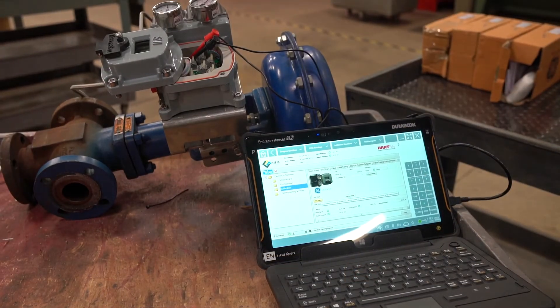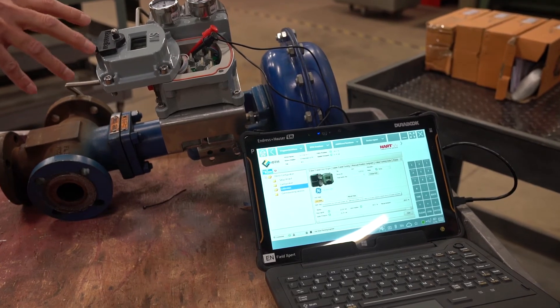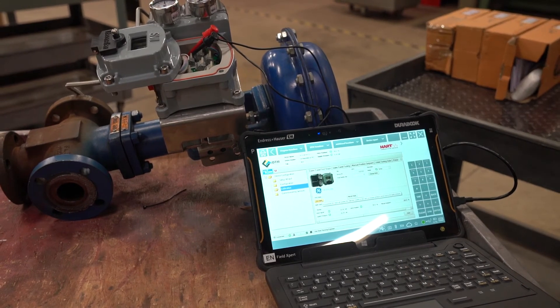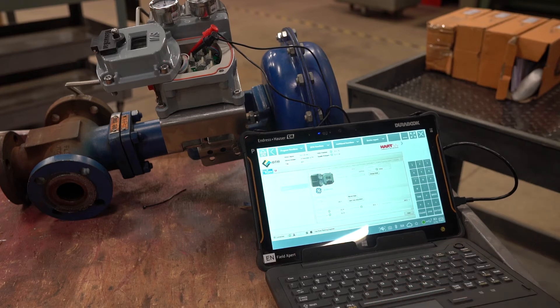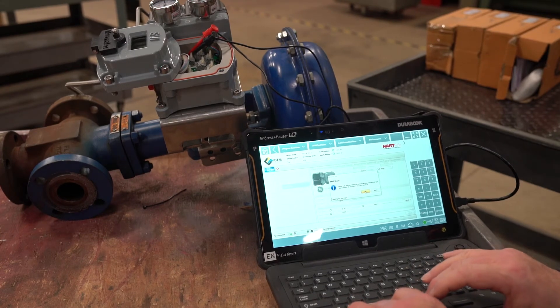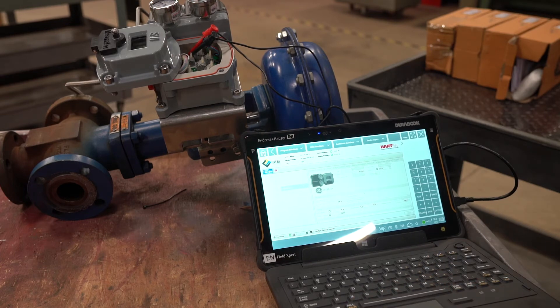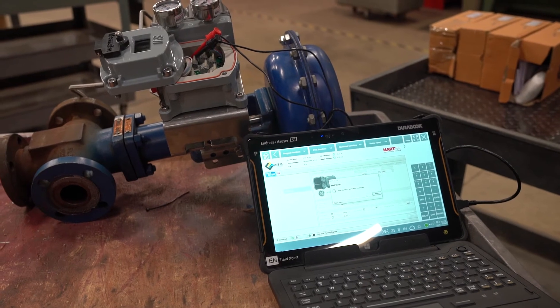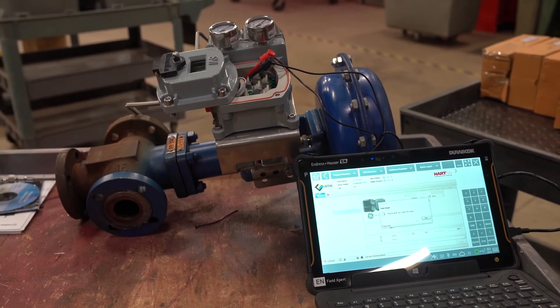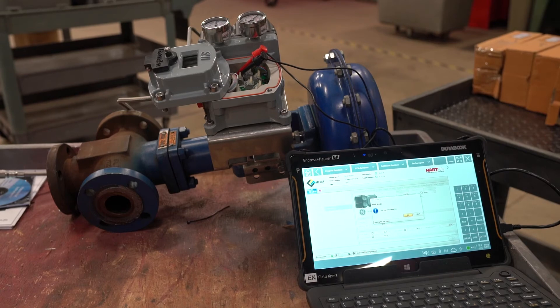We're back here with Roy Cheeseman, focusing on our SMT-70. We have our signal and our air to our valve and our positioner, and Roy's going to run the stops. Roy, what are the stops? It's going to find the fully closed and the fully open position of this valve. Let's do it. This is telling you you're going to lose control — just giving you a warning that it's going to move. Clearly closed. 100% open. And that is it saying you're complete.